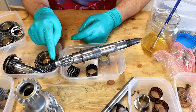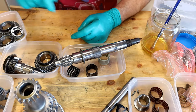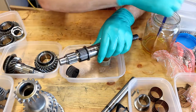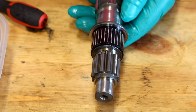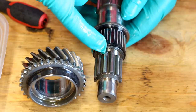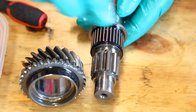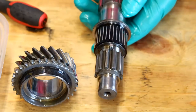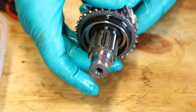The first thing I've done is put the oil over this section here, and then I need to put on the smallest gear with a new split bearing. Put that on, give it a little twist, put some oil over the top of that. I've put that bearing in place and before I slide the gear on I'm going to put the spring and the plunger down that hole. There's the spring and there's the little plunger. I think this is going to be fairly fiddly, but hopefully that will now slide over — and it does.